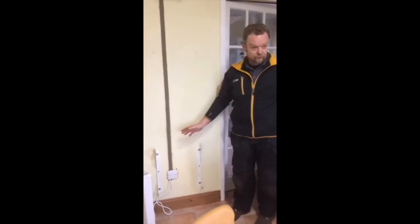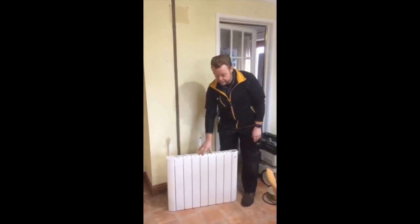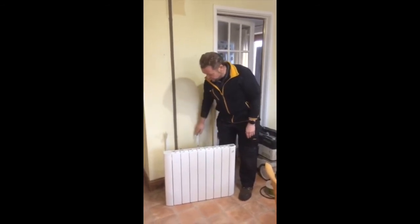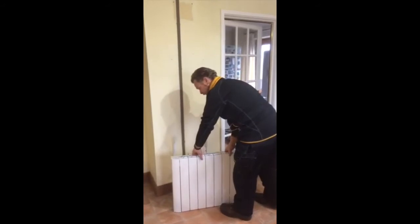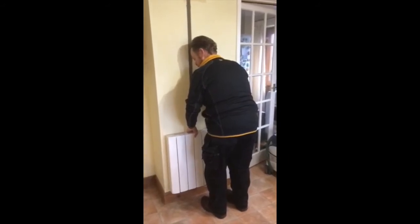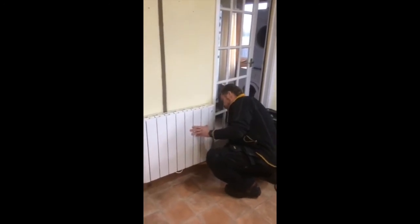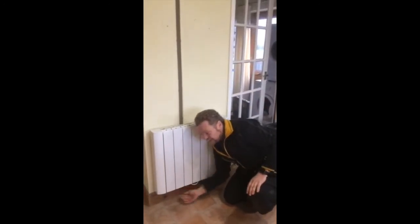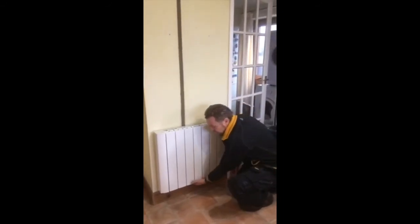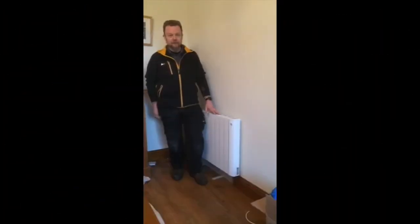It will still be controlled from the switch fuse above, but it's going to work far more efficiently in this kitchen. On this point we're putting the CaliSense radiator, which is compliant with Lot 20 Eco Design, and again we've got the two brackets on the wall. The radiator goes on extremely simply — you just pick it up, sort it onto the existing top point of the bracket as you push the radiator back. There are two hooks that just rotate at the bottom to catch the bottom rail of the heater, and it is now fixed firmly to the wall.